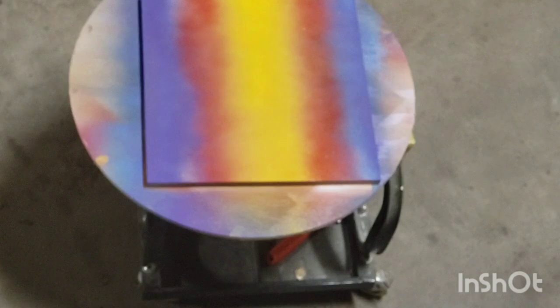My recording of putting the black coat on didn't get saved. Basically, I applied it a lot like the first coat of white — just a single pass doing a 50% overlap, and only put it on as one single coat. You want to put on that black layer as a thin, even layer, so it doesn't take very much laser power to burn through it.